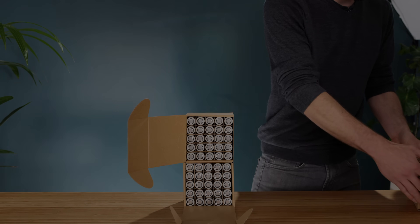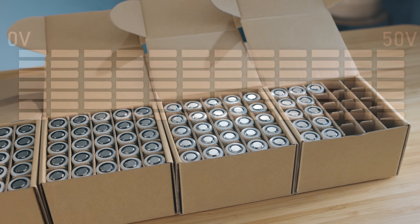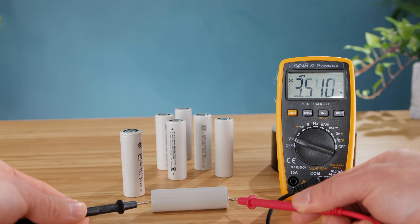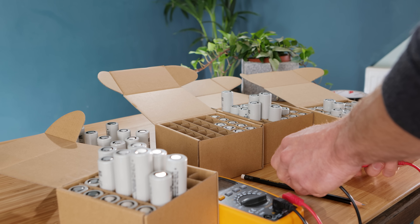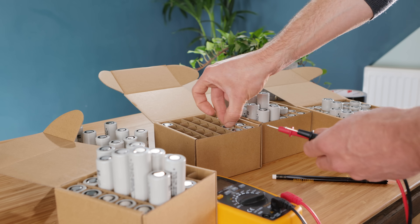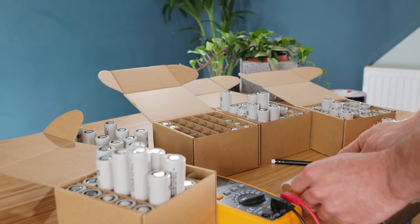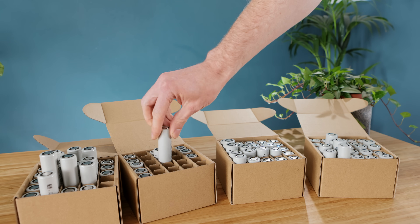I've ordered a total of 84 of these lithium cells for my build, as my intention is to wire up 12 sets of them together for a total of 50 volts when fully charged. Each of these sets is going to individually be made up of seven parallel-wired cells, which adds to the total capacity but not the voltage. Before mounting them together though, it's always good practice to measure the voltage of each cell and put them into groups that match as closely as possible. Brand new cells like mine are likely to all pretty much match anyway, but if old or refurbished cells were used the voltage differences might be substantial enough to cause a lot of current to flow, in which case it would be necessary to first use a charger with a storage mode setting to get them all to match.